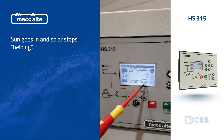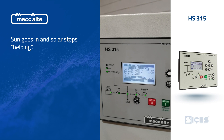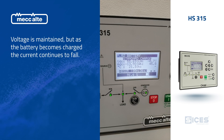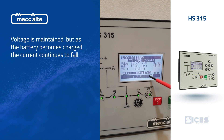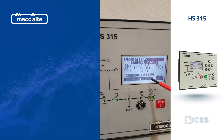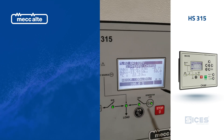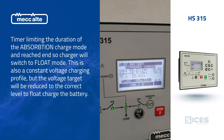I'll kill the solar again and you'll see we maintain this set point but the current comes over to the generator. The generator is picking up the excess load but we're still maintaining our set point. You can see now the current is reducing down to 18 amps, we've still got our voltage set point, and we've still got 8 minutes left or until we get to 12 amps. We're still maintaining our voltage set point of 55.68. The time period may come before the low current set point — 18 seconds left and we're going to go to float mode. In float mode we're going to change this target, set to 114% — so 54.72 volts, which is 114% of 48 volts.